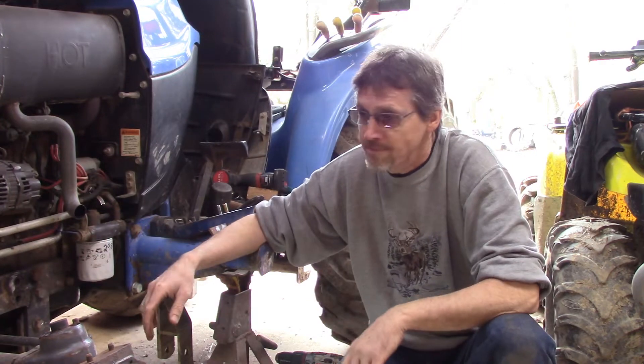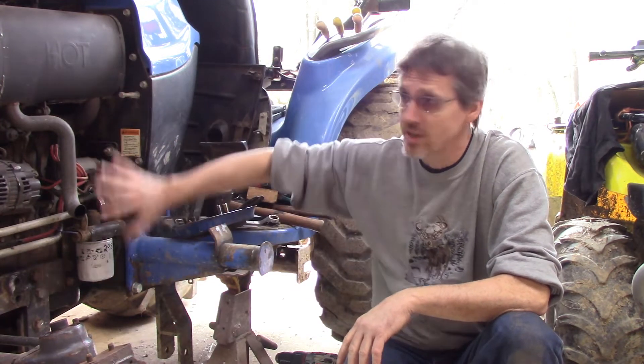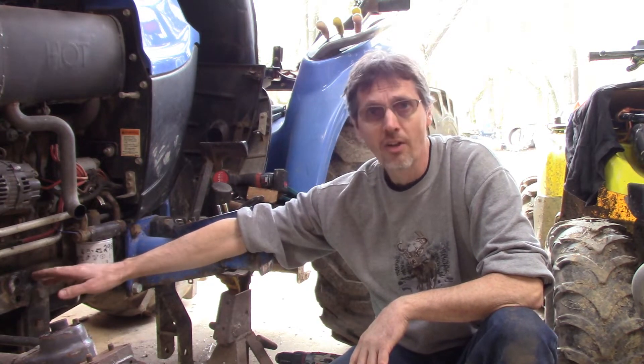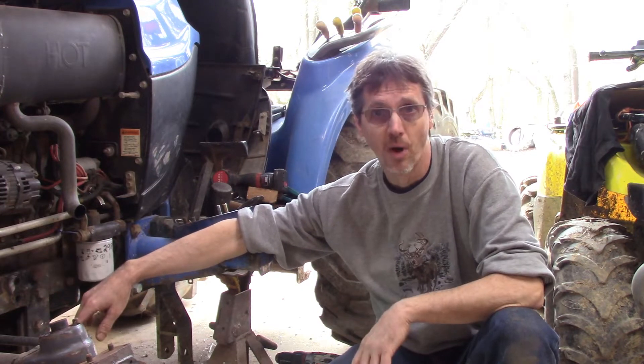When we did that, we lost a lot of hydraulic fluid because of the leak, so I figured now would be a good time to replace the hydraulic filters and the hydraulic fluid. I took the side cover off the engine and put the hood up to change the hydrostatic filter. I noticed right down here on the frame that it was cracked in half. I went to the New Holland dealer — this frame is no longer available — so I had no choice but to weld it.